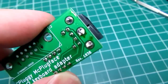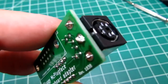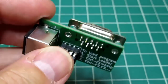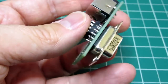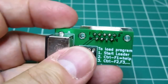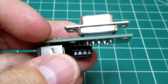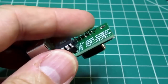I went ahead and soldered in the microcontroller with the chip in the socket, since that's the way it came with the kit — didn't seem to be any good reason to unplug it, solder the socket, and plug it back in. Next the PS2 connector is soldered on. These things are a royal pain — this is only the second one I've ever had to solder, the first being on my Apple One clone. It's really hard to get the pins to all line up. The instructions are also at pains to point out that the game controller connector goes on the back side of the board. I'm also going to cut off the excess pin length since those pins will be in the way when pushing it onto the Gigatron.